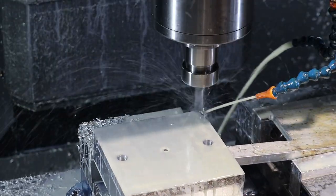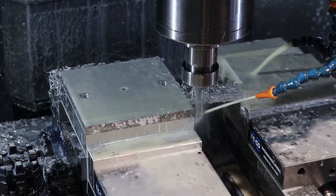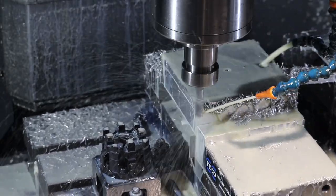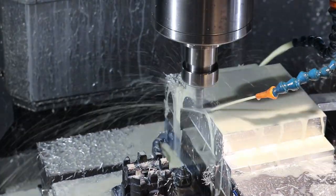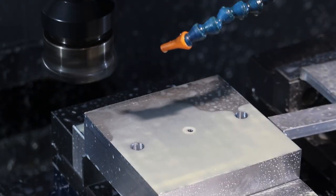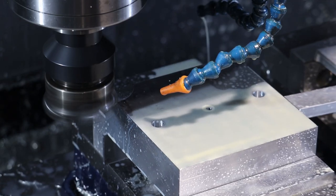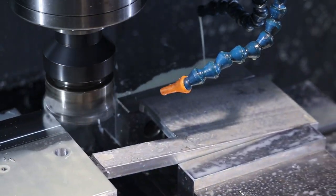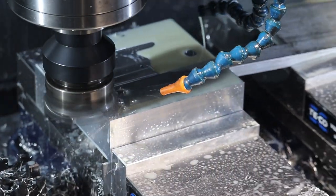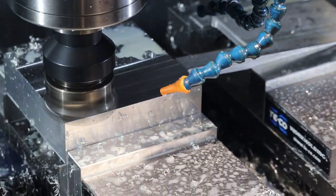I'm double checking because I messed up the finding of the back on the previous mold insert. Anyway, we just blend the edge together with profile machining, and then we're going to shell mill the back of the mold to be square to the front face of this side of the mold. And basically, off camera, I just checked the four corners with calipers to ensure squareness.